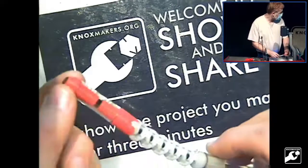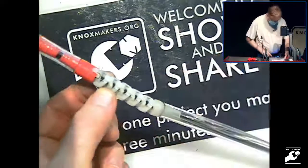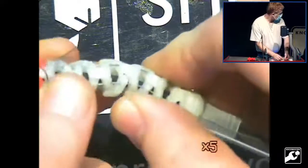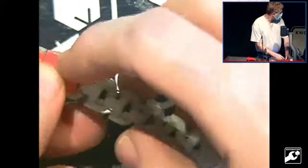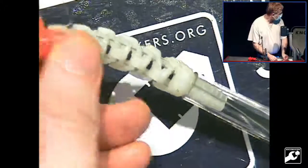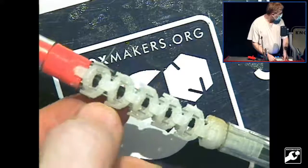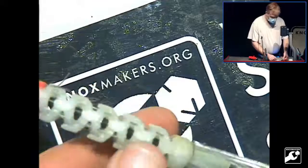So I made this part and then a clear plastic. And then I made a series of these. Each one of these is articulating, and it's got four holes for this wire to go through. Each one can pass it through all the way to the end, at which point it grabs on. So as you pull one wire, it's going to flex in that direction. When I 3D printed these, they would just snap. The things were not strong enough, so I ended up getting nylon. That's a whole challenge in itself to 3D print nylon, but I got that.